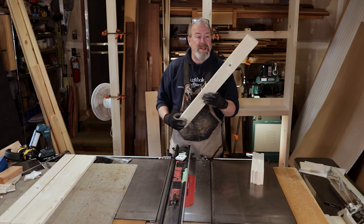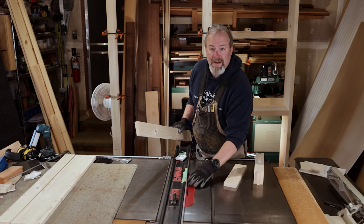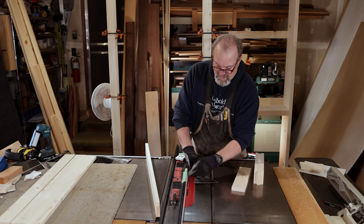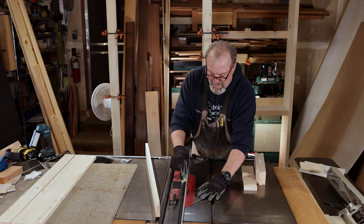What we have to do to these styles is what I call a drop cut. And I think I've made a video of this before. I'm just gonna show one of these doors. We have the blade marked with a square. Hear it? And I drew a line. That's my stop mark. The start mark's over here. It's a start mark, and it's gonna do the same thing. Just where it comes up, you're gonna put a line.